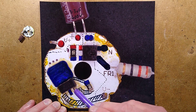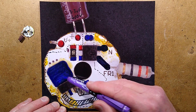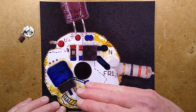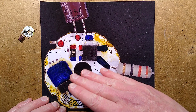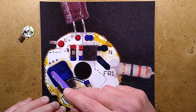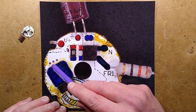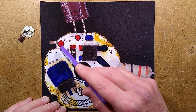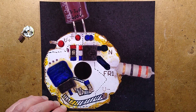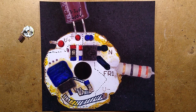The other two components on the board are the linear regulator and its programming resistor. This is a regulator device that limits current - you set the current, it measures the voltage across the programming resistor, and when it reaches a certain level it knows the programmed current is reached and acts like a variable resistor. On the back of the board there are three plated-through holes and a fairly large copper area on this side, with the regulator coupling through to a copper plane on the other side to help dissipate heat. It turns out the LED is dissipating 0.3 watts and the regulator is dissipating 0.5 watts, which is a bit disappointing.